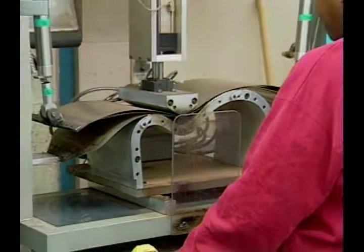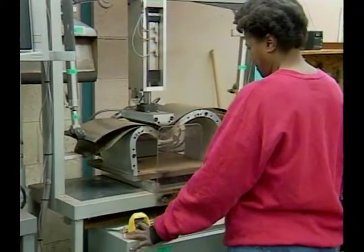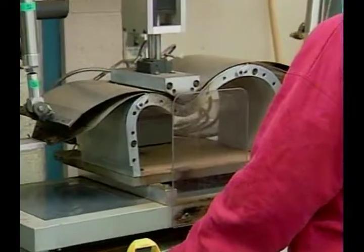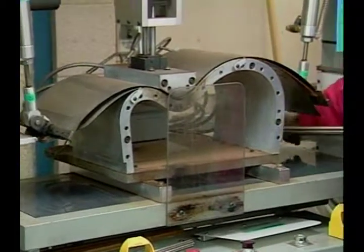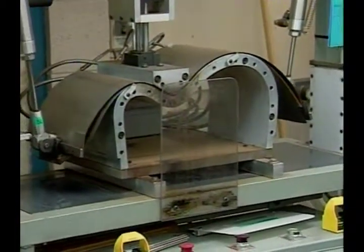From here, we're going to see these parts being bent and braced into shape. What the press is doing right now is bending a set of sides into shape to become the rim of a guitar. This is done through a heated press, and by introducing a little bit of moisture to the wood, they bend right into shape in about six minutes. Each set takes six minutes.